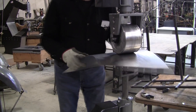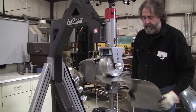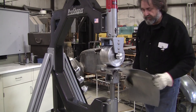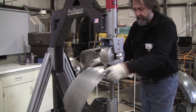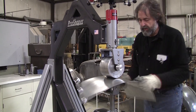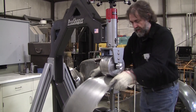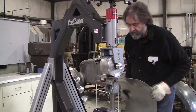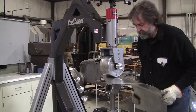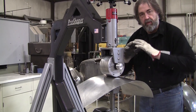So let's put it in again and give it a little more pressure. What's happening here is I'm allowing the panel to droop down, which is causing it to vibrate, and I'm getting a little surface anomaly from those vibrations. But I'm going to take this flat wheel as far as I can to show — this is just a demonstration of how much crown you can get out of just a flat wheel. You get into a decent rhythm and can go pretty fast. The more you go over to the edges, the more you take the shape out. The more you stay in the middle, the more the shape goes in.